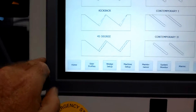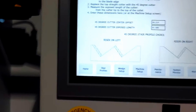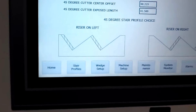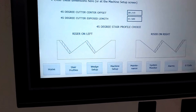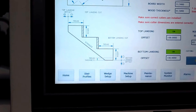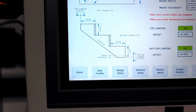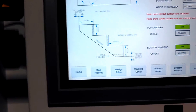Now we'll jump into the 45-degree profile. The 45-degree cut is for doing return cuts, giving your riser the ability to mount without showing end grain. Everything is qualified from the bed, which gives the cutter repeatability every time so you get a nice sharp knife's edge on the bottom of your 45. The landing cut option here will also include a 45-degree cut on the riser, so your first riser can also be mounted without showing end grain.